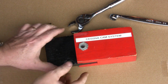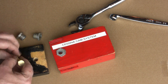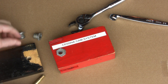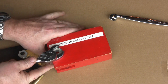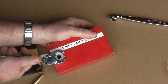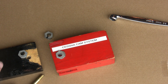On the rear spar of the Cessna wing, this is the airframe right across here. Inside we have a hole on this wing that is the right size for the bolt. In the airframe we have this off-center stub bolt — we call it a cam — and that cam can be adjusted upwards and downwards. If I adjust that cam, it would put the rear of the wing down, or up. It's not enough to make very much of a difference, but in a slight situation where there's a small amount of discrepancy in lift, that is going to make a huge difference when it comes time to fly.